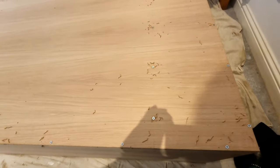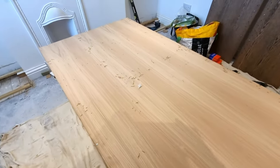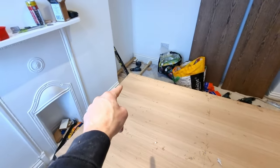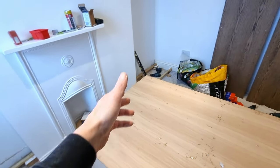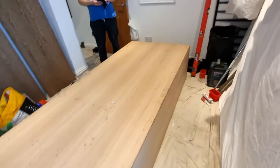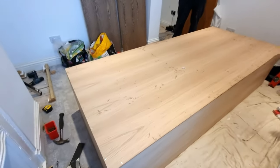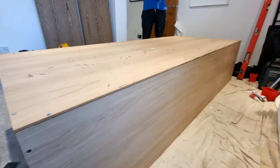We use 30 mil screws to put the backings on — we don't use pins, we don't use glue. We just line up one corner first, get the short edge screwed up. Before we screw it up we use a 3 mil drill bit to pre-drill, knock those screws in, and then just make sure it's flush all along one edge. Then we go around the remaining sides — if you haven't got any support on the inside or any fixed shelves, just make sure it's flush as you go along.